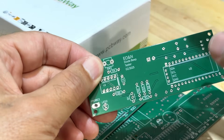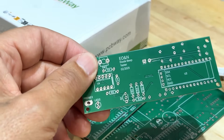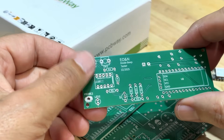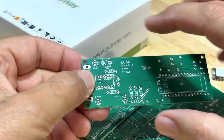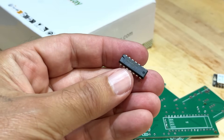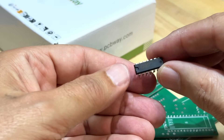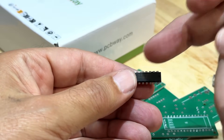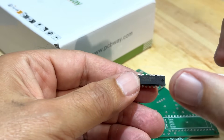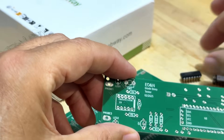You can actually create a polarity reversal with programming using an H-bridge, and I agree. But since I'm going to have a switch anyway, I'll probably use it to flip the polarity. I won't be using the relay anymore because that draws about 15 milliamps of current. I'm probably going to use the CD4066 - it's a quad analog switch, CMOS so it doesn't draw much current. You can wire those four single-pole single-throw switches as a double-pole double-throw, which is exactly how the relay was wired to reverse the polarity.